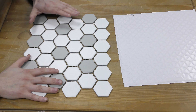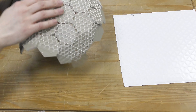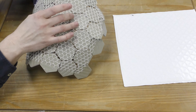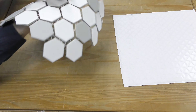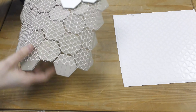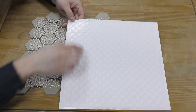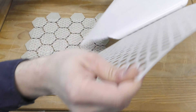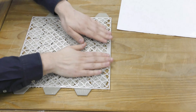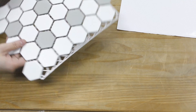When it comes to putting your tiles on the wall, you'll notice there is this wonderful mesh back which you can cut easily with a craft knife to get round light sockets and corners. But it does make them a little bit difficult to handle. If you want a little bit of extra structure and to make them more secure, you can invest in the mosaic backer mesh — simply a sheet of plastic that you peel off and then with its self-adhesive backing sticks to the back of your mosaic. That makes it a lot stronger and a lot easier to use.